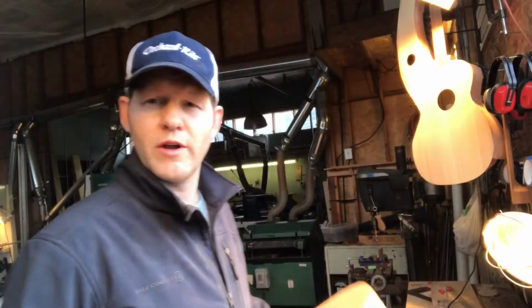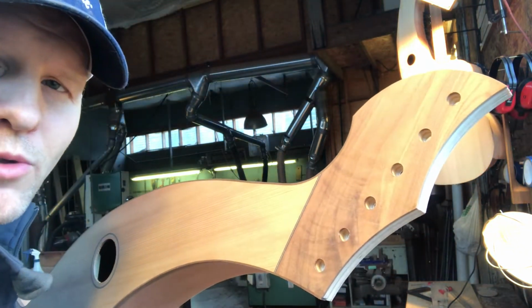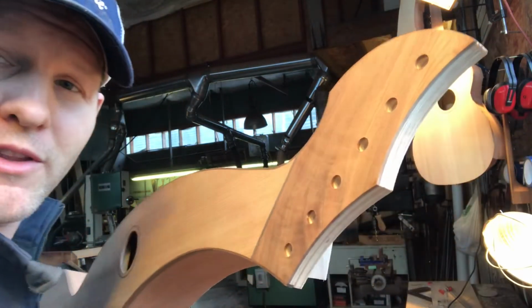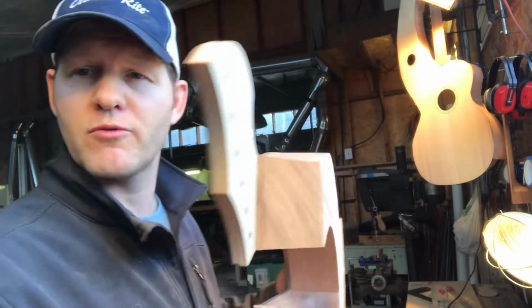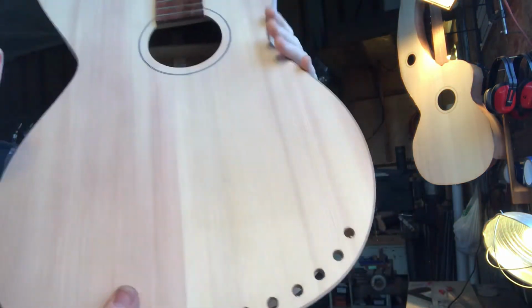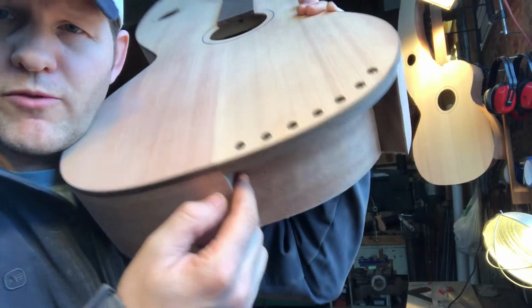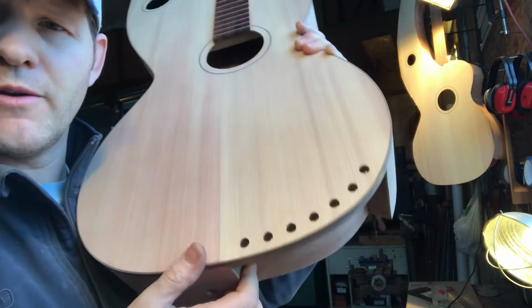All right, so anyway, I was trying to show you guys all these holes drilled, but it doesn't work very well on time lapse. So anyway, there's the nice holes in the harp head peg block there for the nylon string tuners. Also the super treble holes, and Dave made this one available for 7 super treble strings, so it's got an extra big tuner pocket there.